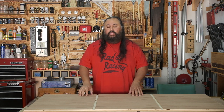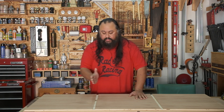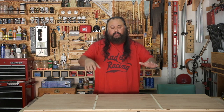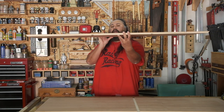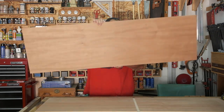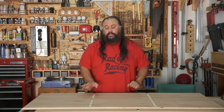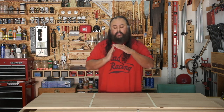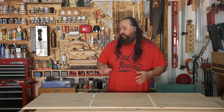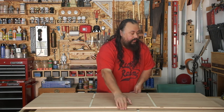And this is where I was talking about getting it specifically for my room. It's got 2 dividers because that'll be like this, right? So that'll be on the top, and that first row gets these 2 dividers because it gets 3 drawers. The top itself is gonna be mitered so that you don't see a seam or any edges, to hide the plywood essentially.